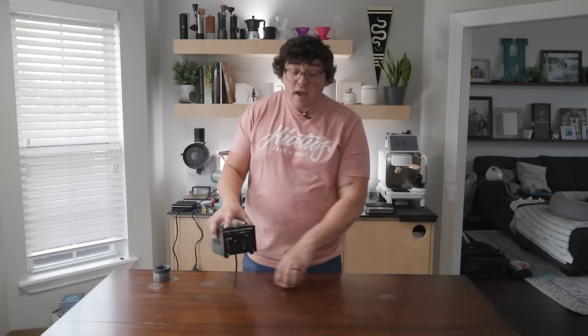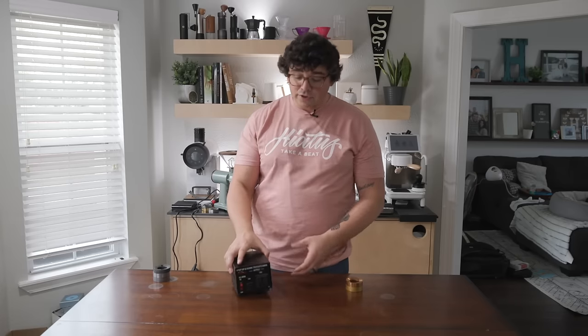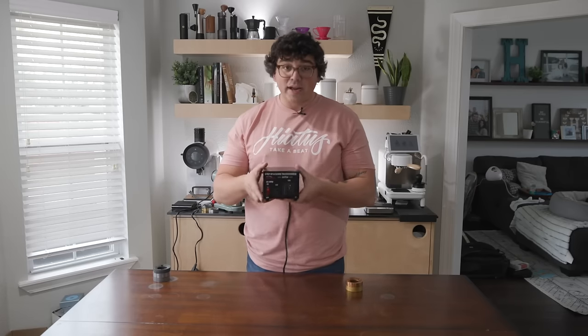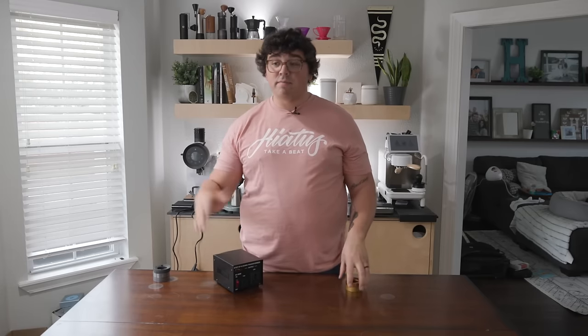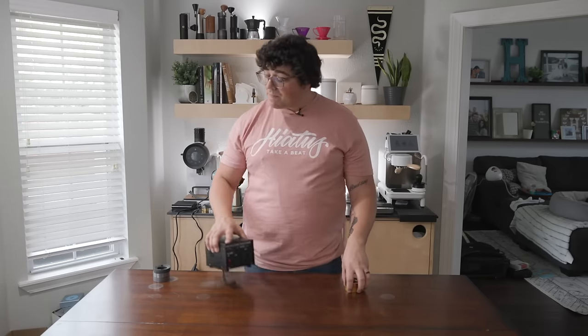A lot of these grinders, especially the Akira Koki, only come in 220 volt, which for us in the United States of America, we'll need to have some sort of converter. So you're going to have to get a transformer in order to transform it from 220 to 110 so it doesn't mess up your wall, unless you have an outlet that can handle 220, in which case you're fine. But keep that in mind when you're purchasing these, that if you get one that is rated at 220, do not just use an adapter. Do not just take something that can fit your wall socket and go, it will not be okay. You need to have a transformer.